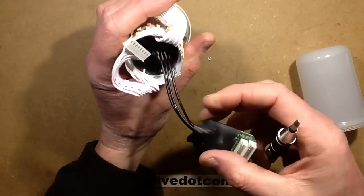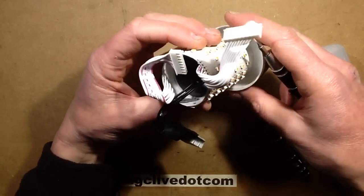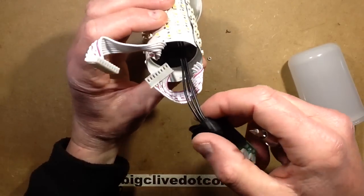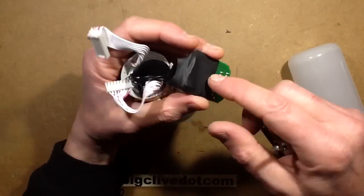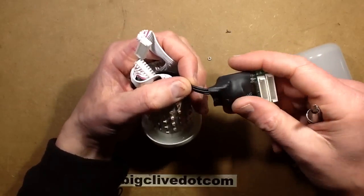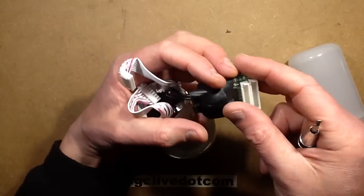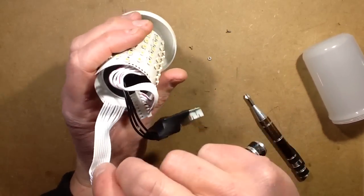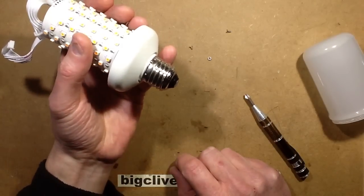This is dividing down into multiple bits of circuit already. Let's see if I can get this tape off. There's what looks like a small power supply down here, providing power up to the top. I'm guessing the reason it's got three connections is it's providing maybe 5 volts for everything, and then maybe a reference for the turning on and off of power — maybe that's actually being detected in here. I do kind of want to take that out from the base. I do want to take the whole thing to bits. One moment please — okay, that's it thoroughly in bits now.